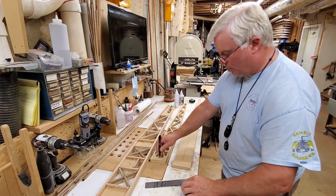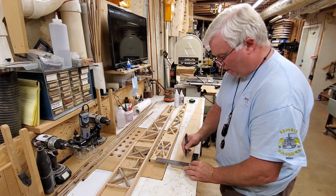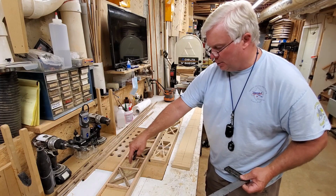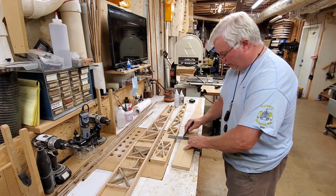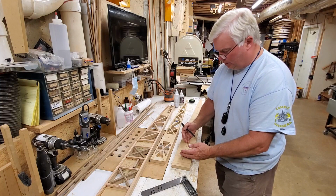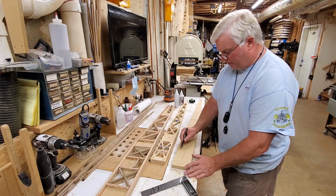And we want to come off the front, probably, I don't know, maybe the thickness of this thing here, it doesn't really matter. So we can cut lightning holes out of here. We want to leave this intact, and we want to leave this area intact, because that is underneath the wing tube. Don't know for sure that we need to leave it. I just always have. And it's a good platform for the fuel tank to sit on. So we've got meat here and meat here, so the fuel tank can sit on top of it. And we'll put a lightning hole right here and a lightning hole right there, probably rectangular ones. I don't think it needs triangles down there. A good rectangle will be fine in both of these areas here.